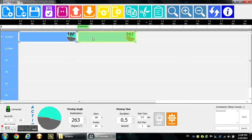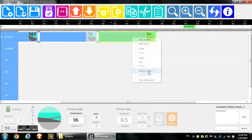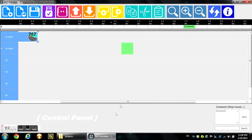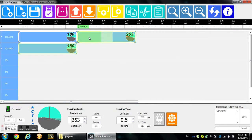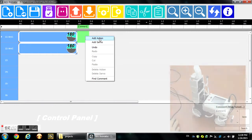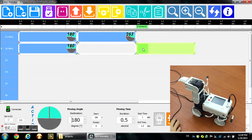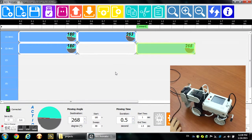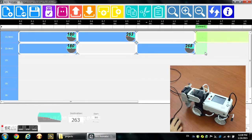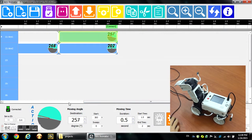That's a two-part sequence. You can add as many actions as you want — a third, a fourth, a fifth, and so on. Now we're going to try a simultaneous movement, controlling both servos at once. You can have more than one action running in parallel at the same time. Here I'll make one servo blank during a duration so only servo one moves, then leave the top one blank so only the second servo moves, and finally add an action where both servos operate at the same time.